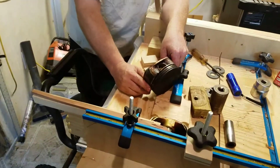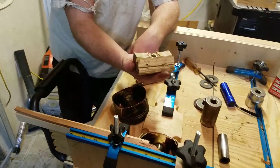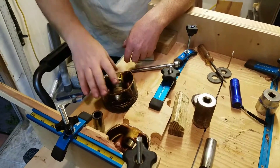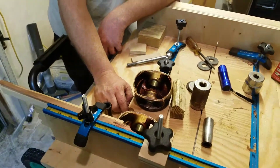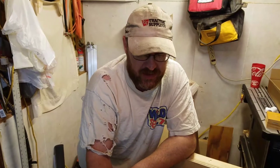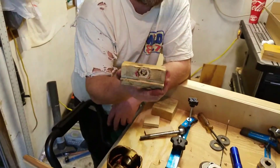They must have a special tool that fits the rounded sides. Our special tool is the wood block — it saved us from having to go to the machine shop after the pins locked up on us. Getting them repressed at a shop was quoted at $10 to $20 per piston, so for all eight pistons you're looking at $80 to $160. Our wood block was free — just a cutoff scrap piece sitting right here.